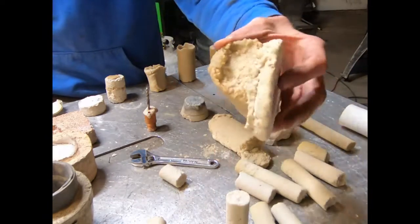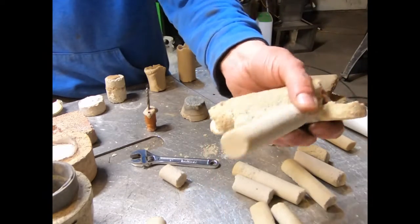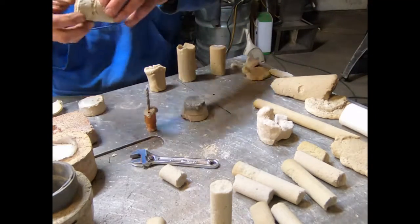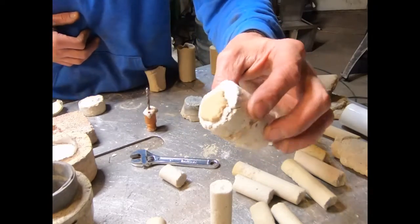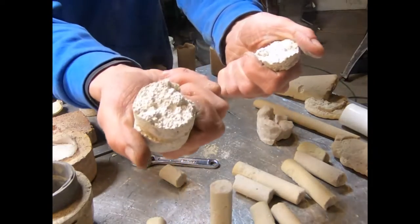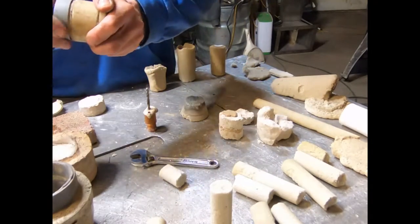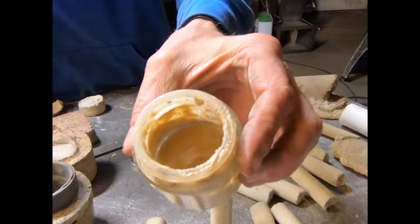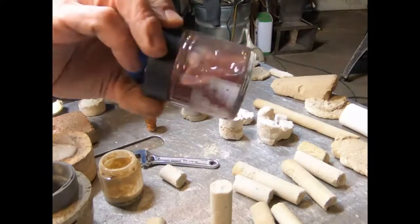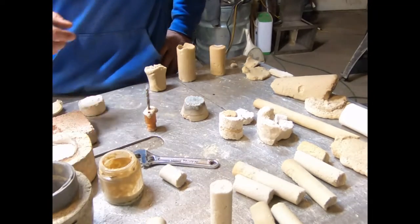On these I decided to paint them with more water glass — I took this part and painted it, and that's kind of what happened. Nonetheless, this is a piece of the refractory glue, and I glued these two pieces of refractory that I made together with it — wow, look at that. So the refractory glue I've had in the jar for a long time is made out of garden lime and water glass — which is made out of sodium silicate, the desiccant beads, and sodium hydroxide drain cleaner.